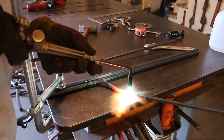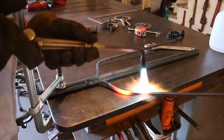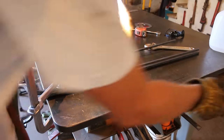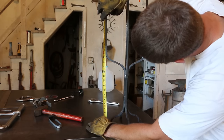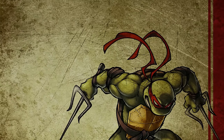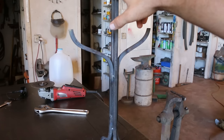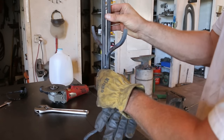Then I'd move the flame forward and heat and bend that spot. I did this five or six times until I had a matching radius on the arm. The metal bends much more at the hottest spot and it cools quickly too, so it's really easy to control where the bending is taking place. I had a little bit of tweaking to get them lined up across from each other when looking at it from the side, but I was happy with it eventually. I measured up from the table on both sides to mark a cut line, making sure they were the same height. I thought about stopping the project here and turning this into a ninja weapon — I've been a lifelong fan of Raphael — but I realized if I didn't get this done my sister would probably do more serious physical damage to me than I could defend against even with my new ninja sai, so I kept going.